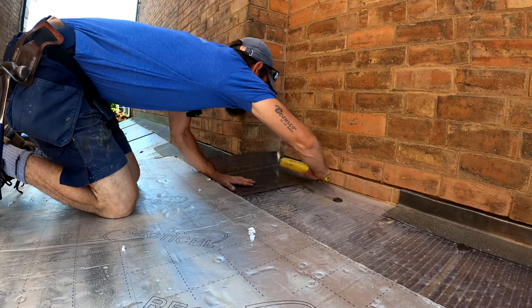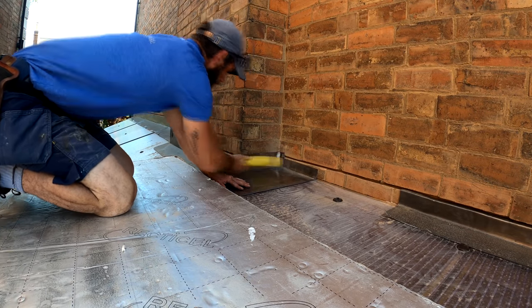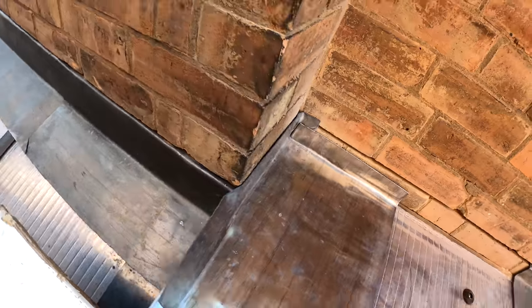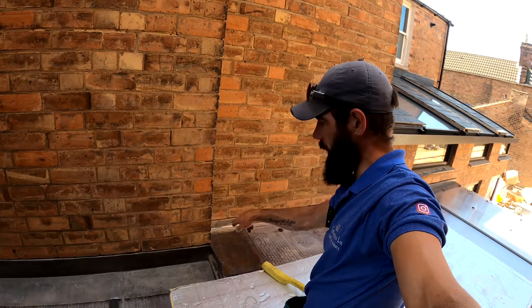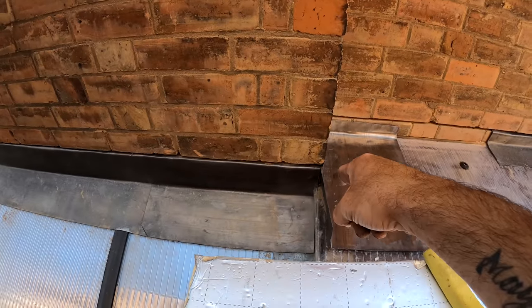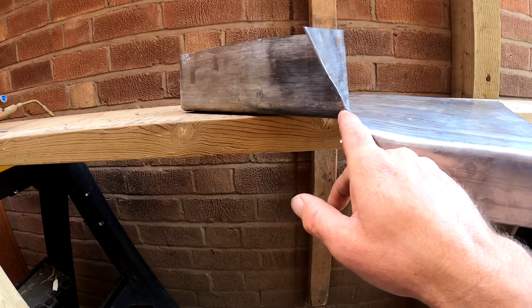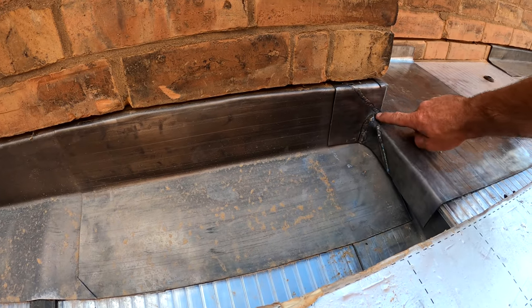Alright, we get that just in there like so. Got our wraps down here now, coming around here into our corner, and then it's coming down here. What I'll do next is I've got to get this piece of lead somehow around here, down and up here. The way I'm going to do that is by cutting it and doing a weld. Once I've got the weld on the lead, I'll then get another piece, cover that in, and she's watertight. So this point here now is watertight. If you come around the side — got it coming up to here, all going in here, up into the corner, and it's coming around to here. Then we've now got our upstand up here.